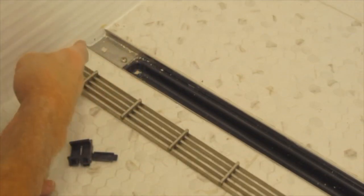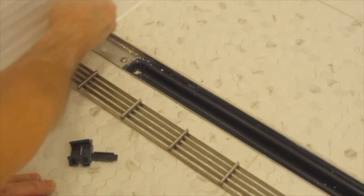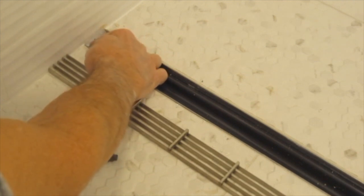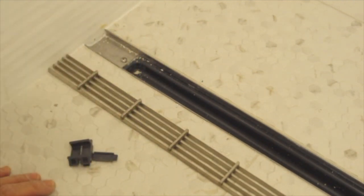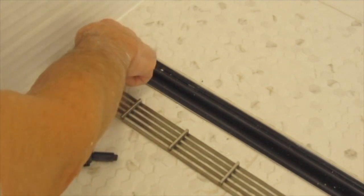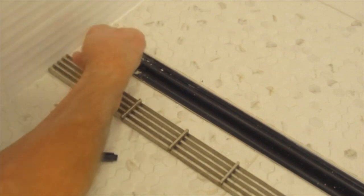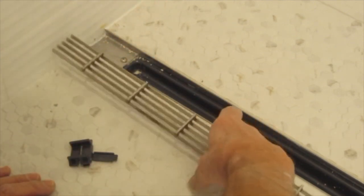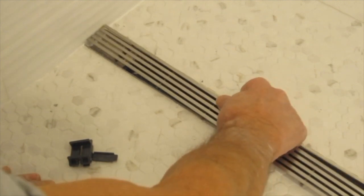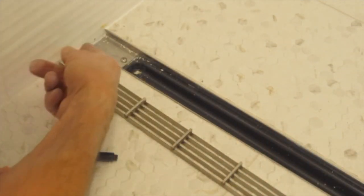To back up a little bit — when I'm cutting my first row of tile here, I like to leave a little bit of a tab of the tile to come down to that drain extension. It just gives you a little more to caulk around and it doesn't leave a hole. It's a cleaner finish when you put the cover on to know that it's butting up against tile, as opposed to cutting it straight across and getting lazy.